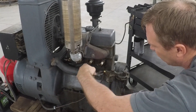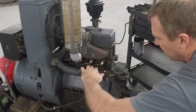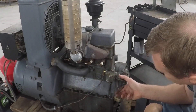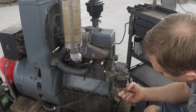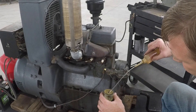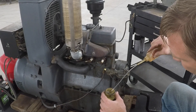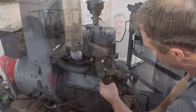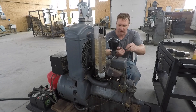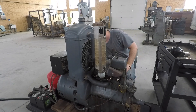Had the power out for probably five hours back in August. After two hours, I fired this up and ran a cord in the house to keep my refrigerator going. Let's see if this primer will suck the air out of here and bring some fuel, or if I'm going to have to prime it manually. Sometimes they just don't want to prime — it's hard to get that air pumped out enough. I'm not really having any luck getting the prime. It'd just be easier to shoot some fuel down the carburetor and let it run to prime itself.